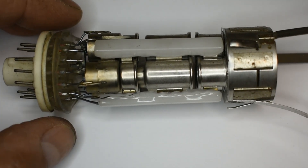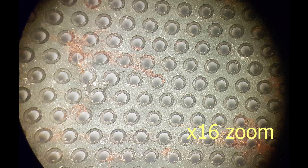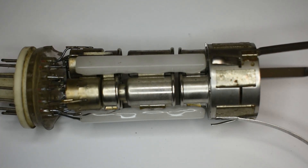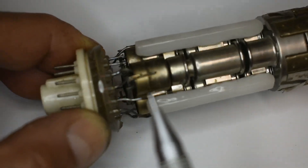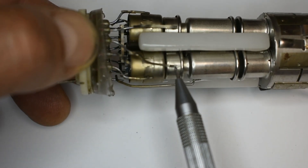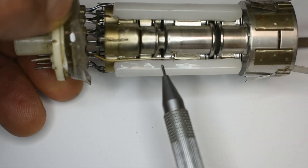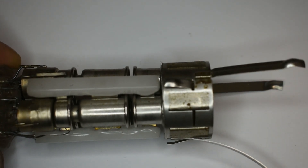This type of electron gun also had to come with a shadow mask. There's a very good nitrate test film available on the internet — I'll put a link showing the manufacturing of this CRT by Mullard. At this point we still had separate connections: three connections to each of the grid assemblies, and a separate connection for each first anode. The focus has only one connection and the final anode has only one connection because it's connected to the internal coating.